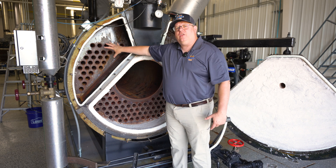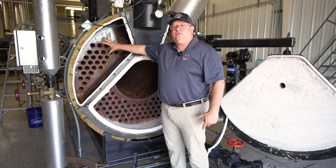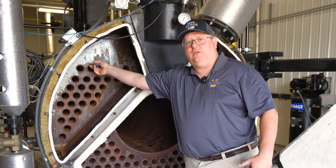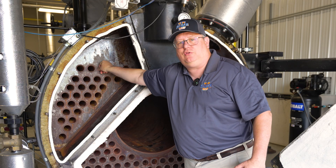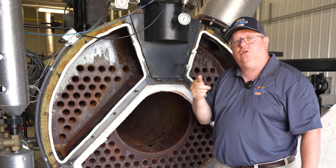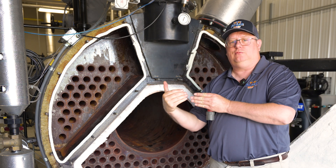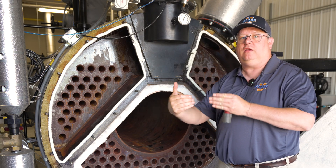That's also the nature of a beaded tube end. A beaded tube end is rolled first, but then a chisel type tool or rotary type tool is used to fold the end of that tube against the tube sheet. So that gives us heat transfer.